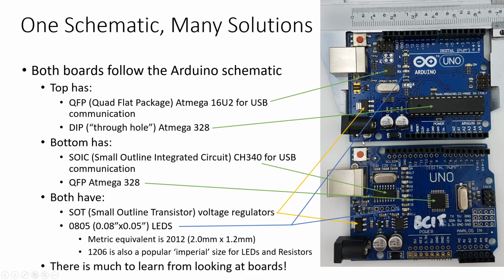Most of these boards will be assembled by a robot, and they'll go down an assembly line, and a pick-and-place robot will pick the parts, the capacitors, the resistors, the chips, off of rolls and rolls and rolls of this material, and place them onto the board. There'll be a little bit of solder on the board. It'll have been applied with a solder mask, wiped across the board. And then they'll just keep flowing down the assembly line through an oven where the solder will all be melted. They'll come out the other side and they'll be tested.